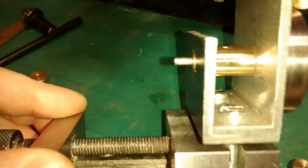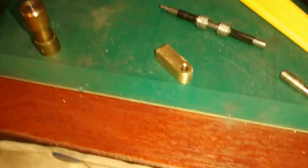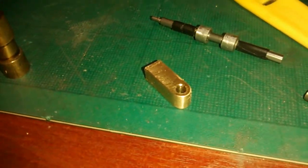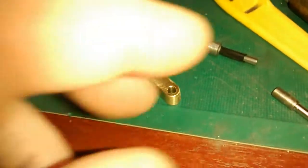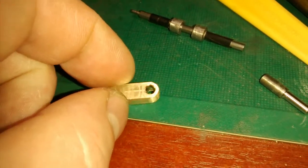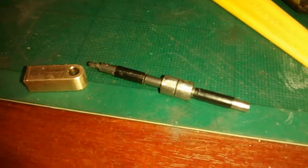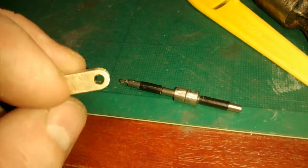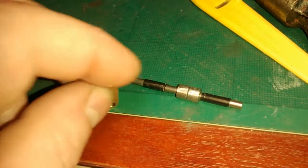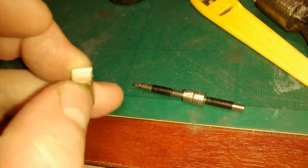I had to file the little shoulder off this side. Now I have the bottom of the piston rod made, and it's much, much better than the one I originally did, because I turned a couple of 6mm buttons and used them as a guide for filing, then finished it off on emery paper, so it's turned out absolutely fantastically.